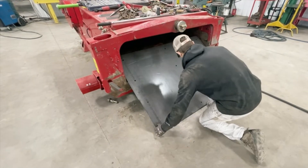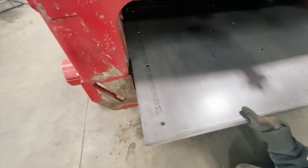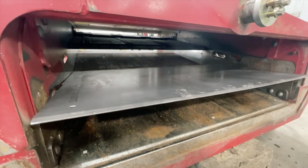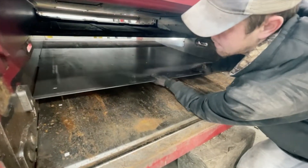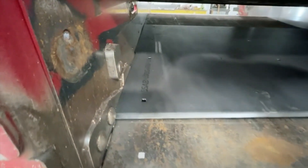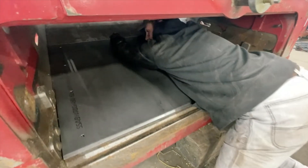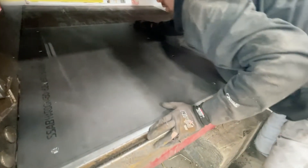Last piece going in. Notice the cutouts right here — that's for the curvature of the throat; they have to go this way. I usually slide it past that one, let it fall down, and then bring it back. Bring it all the way down until it stops. See how it's flush now? You can move these back and forth — just go until you cover that front lip.